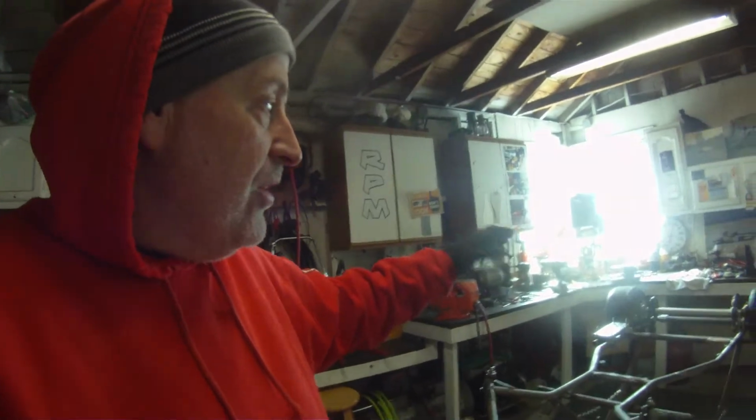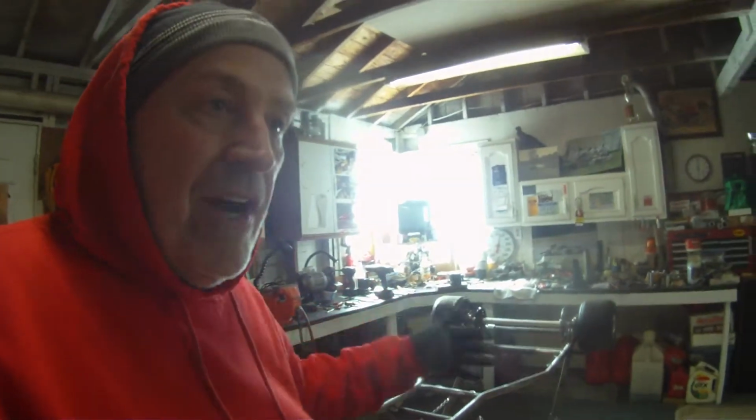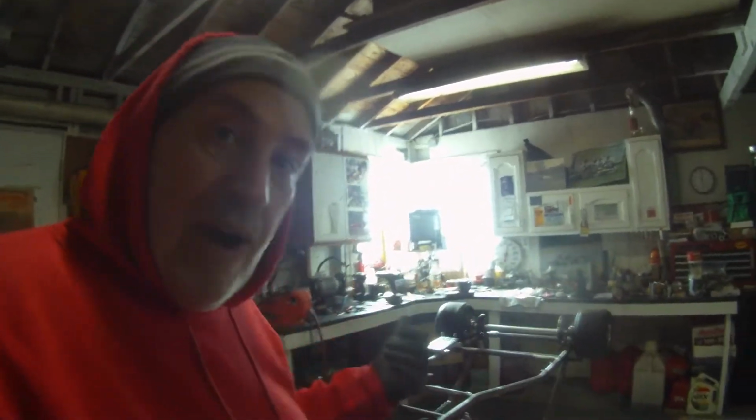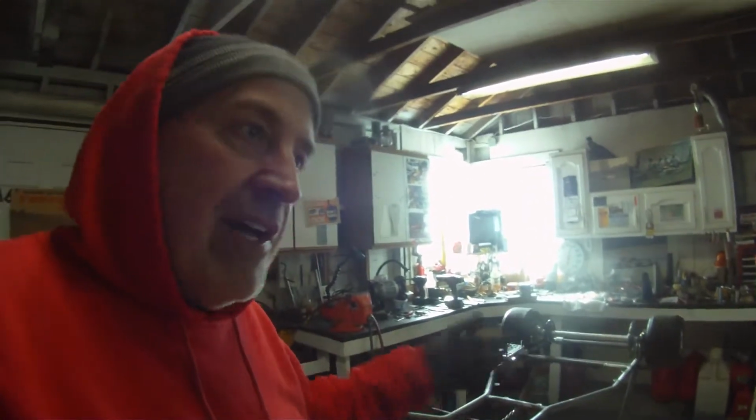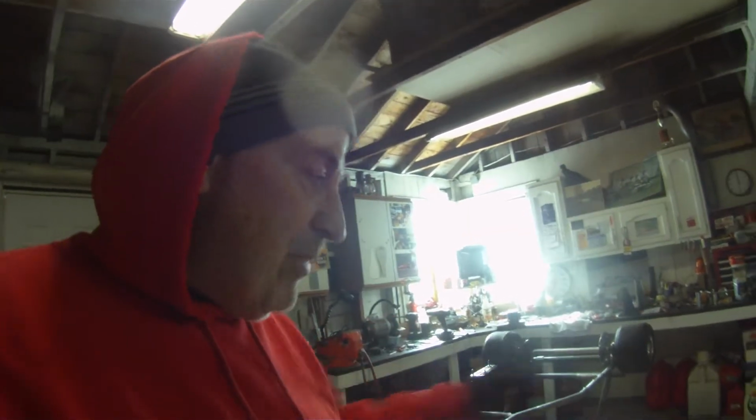Mounting the pipe to the chassis to support it when the chassis is flexing and that 4-stroke engine's vibrating like crazy. From working at the indoor place where we ran Hondas, we pulled a bunch of studs, exhaust studs, right out of the heads. So we were buying, for lack of a better word, short block heads and putting our valves and BS into it all the time. Or we tried at first using helicoils, and obviously it didn't work. What we ended up doing there, and I told Bob about it, that stopped all this, is we started using flex pipe.